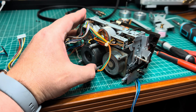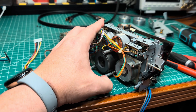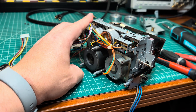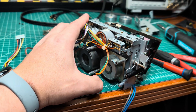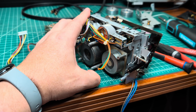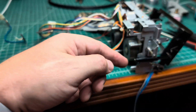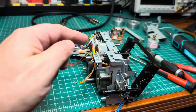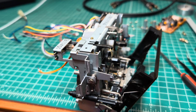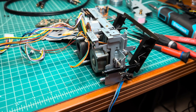I installed the base with the bearings in the same way, lubricated, and you can see how long the capstan spins — it just keeps going, which is how it should be. It's fixed with three screws from the top. We're missing one screw because on the DR1 we have a head adjustment mechanism where that screw would normally go, so there's just no room to have it fixed.